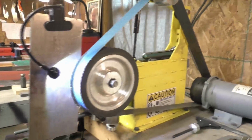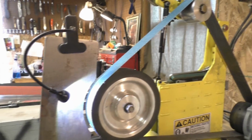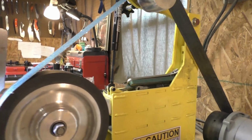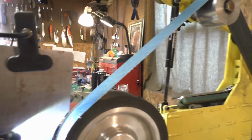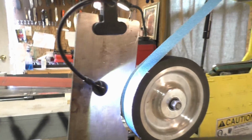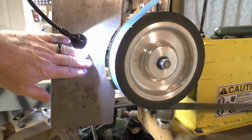And this right here is an Oregon-made grinder. I kind of modified it. The shock spring that came on this was not strong, and it wasn't tracking right, so I put a larger arm on it. So I run a 75-pound air shock on that now. But I also built this thing. It's a D&D rest, and I modified it, and I flipped it over so I can use it horizontal. I just keep things flush against it.